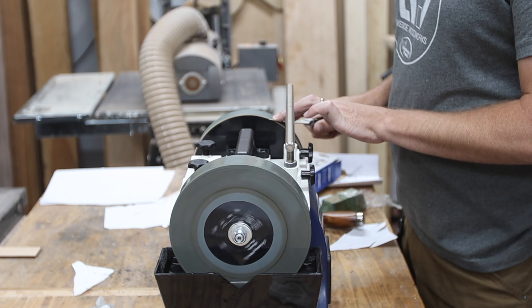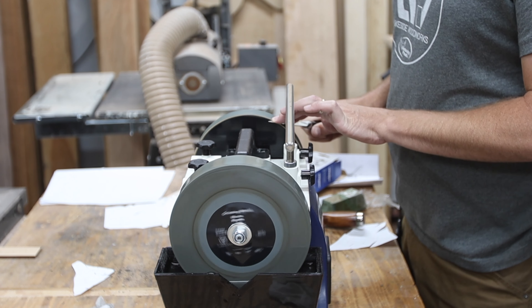I've had pretty good success just removing the knife from the jig and doing the strop part by hand because it's a little more forgiving with the leather. I'm going to charge it up with a little more compound and hone this edge. Just feeling for a burr — it doesn't feel like there's one left, so that should mean it'll cut pretty well. You can see a much more polished edge. Cut the paper and see how it goes — cutting pretty good.